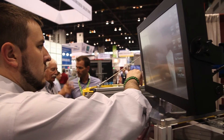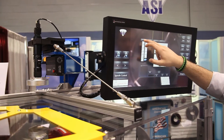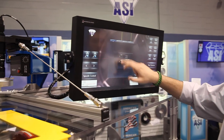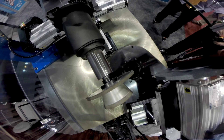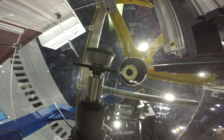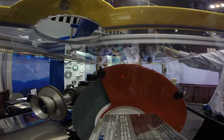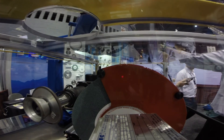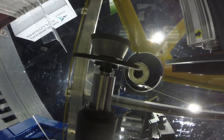The machine is available with two different work heads. One of them is HSK, which is very flexible and used on a lot of grinding machines, making the wheel packs directly adaptable to our machine. If you have grinding equipment that requires SK-40 or big plus spindles, we offer a different work head which is the SK-40, also with push button release. These things all make it very user friendly and give us the ability to deal with just about any grinding equipment you might have.